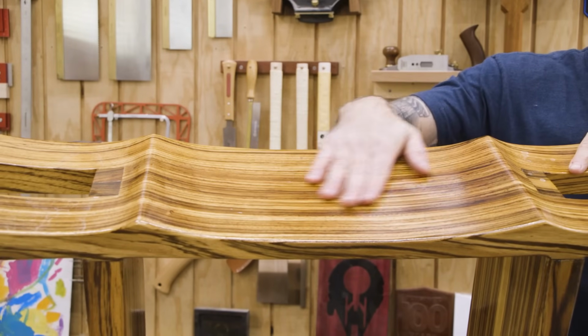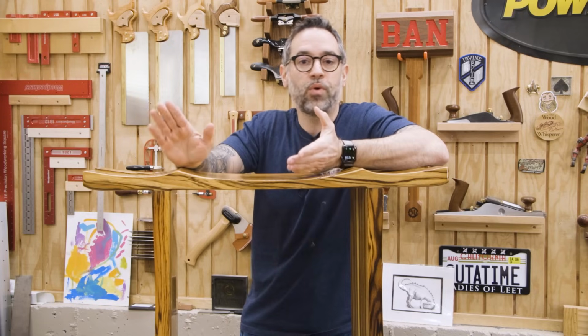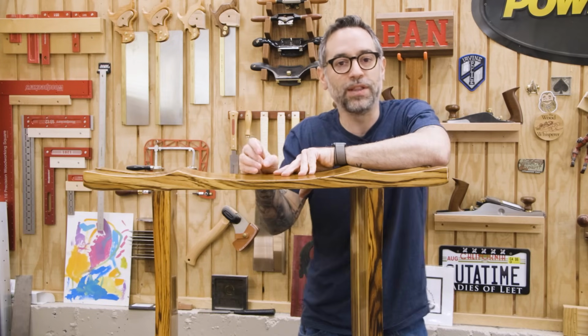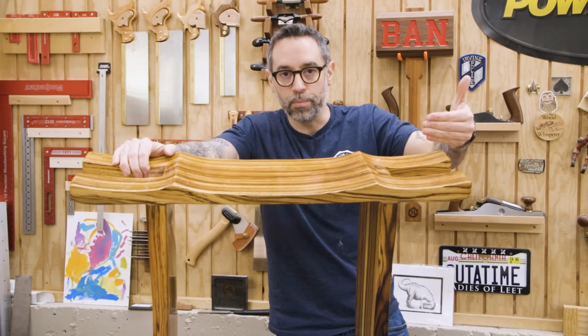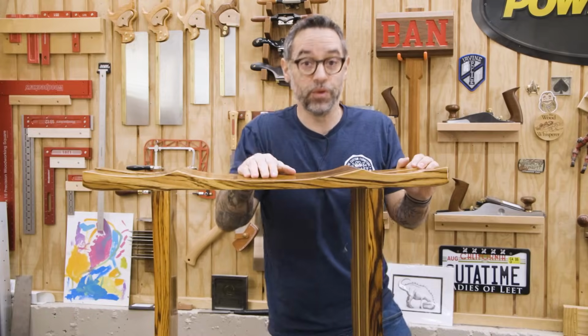I don't see any place on this piece where I think it needs to be refinished. And that's just an important data point, because UV is terrible. It's absolutely the thing that's going to deteriorate the finish and then allow moisture infiltration. So this piece with tons of moisture exposure, of course in short bursts, still is in great condition, right? So very important data point there.